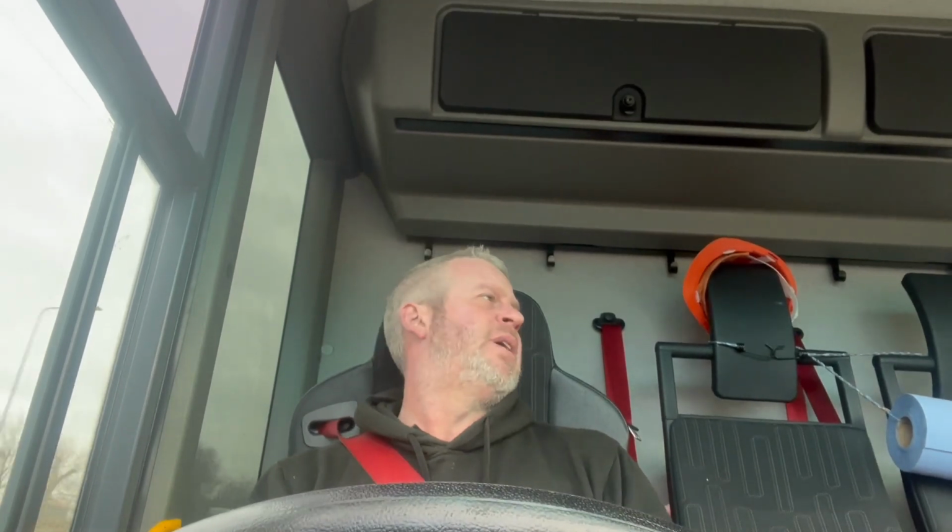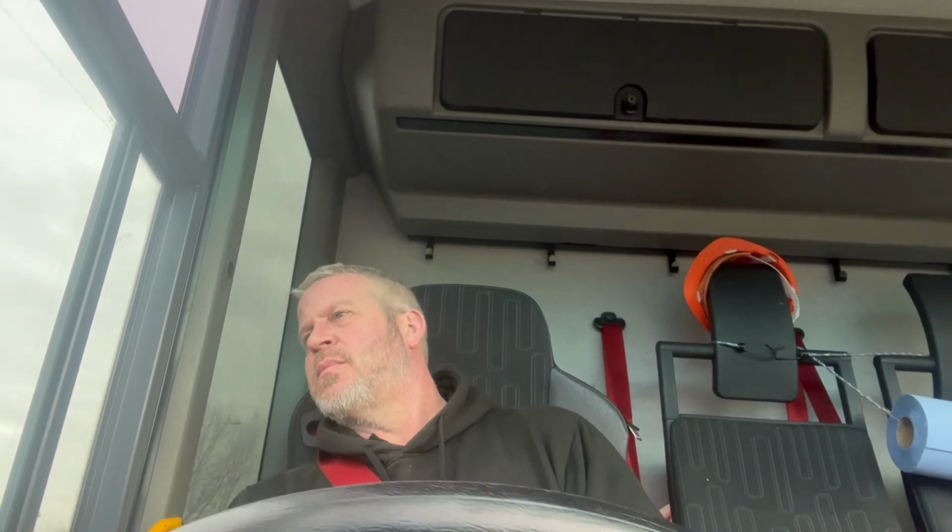So we're up to 50 mile an hour now, and past these wagons in this lane there. Checking my mirrors. Nothing behind me. I've got the steering wheel, it's still in a straight line. We'll start braking now. Started braking then, it was slightly pulling to the right.